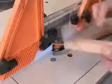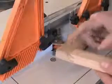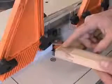Insert one of the end grain cuts into the long grain test cut you just made. Check to see that the two faces are even with each other. If the board with the end grain cut is too high, you'll need to raise bit number two. If the board with the long grain cut is too high, you'll need to lower it. When the height of bit number two is correct, slide the infeed fence into the spinning cutter to produce a zero clearance fence and reduce chipping. You can now machine the long grain cut into your door frame parts. Be sure to keep the face of your parts up on the router table.